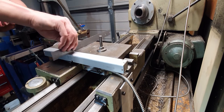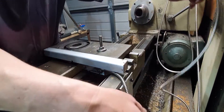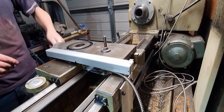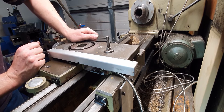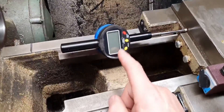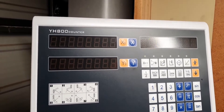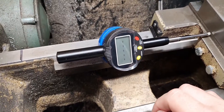We've got that just below our surface which is what we needed, so that was all good - it's all now connected. I'm going to have to route all these cables somehow. I don't want to deal with those yet, but I just want them where they'll have as little strain as possible, so we'll play with that. As far as things go, we're all set up and running. What we'll do now is turn on the DRO itself and check the accuracy. I've set up a digital dial indicator on the Z travel - we'll set up the DRO and make sure it's reading the same as the dial indicator. We'll switch it on and it goes through a startup process.